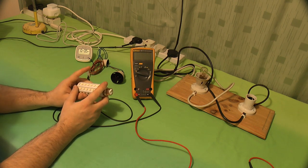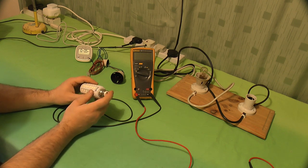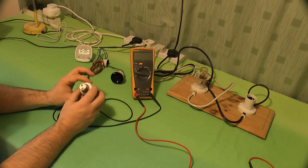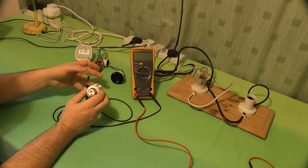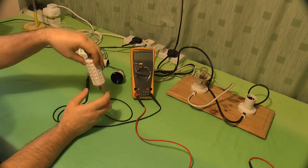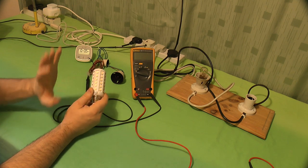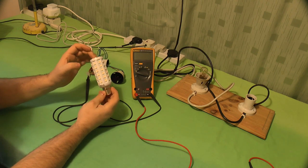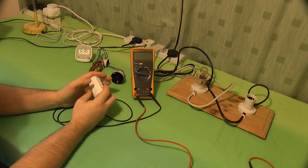Because I have seen another YouTube video, and I'll put a link in the description to the other video, with someone showing off one of these GU10 mains halogen replacements. They were testing it with a meter and looking at the circuit diagram, and there were a lot of high voltages. Depending on which way you fitted it in, there was a pretty good chance of getting an electric shock from the LEDs. But anyway, we'll scrub that. That was the GU10. This is a completely different fitting, completely different manufacturer. So let's go and check the light output in a fitting.